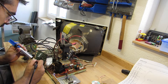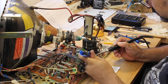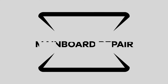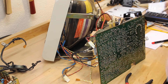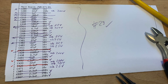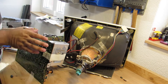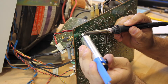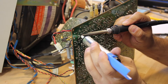I didn't do any closer inspection on the neckboard or the caps whatsoever. As I have a full recap kit, I'm about to replace all capacitors. For the neckboard, this proves no bigger challenge. There's a total of 29 caps on the mainboard — it will take a while to fully replace all of them. To simplify things, I'm keeping track of the ones I have replaced already. It's a tedious and repetitive task. At least, the mainboard has printed indications on both front and back side to denote the correct polarity orientation of the capacitors.